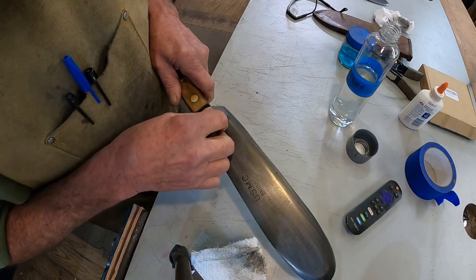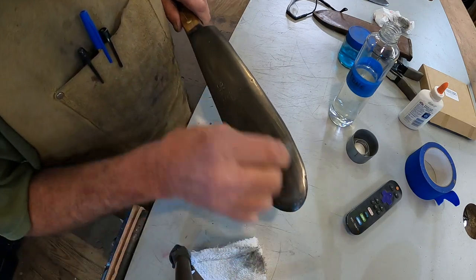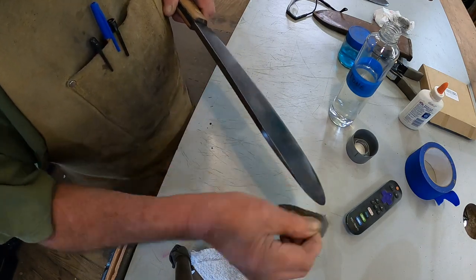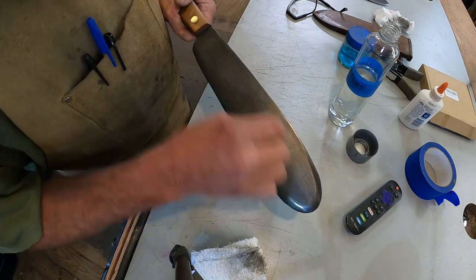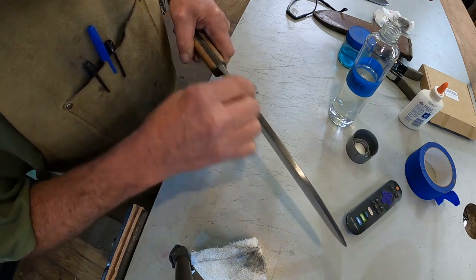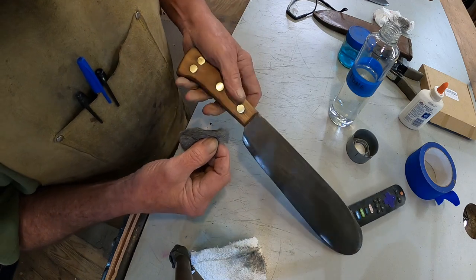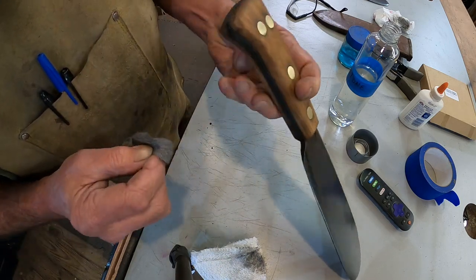All right, go through a couple of steps here. It's been rinsed. Now you take it to steel wool. Polish it. That's to get the residue off of there. Try to even it out some. All these instructions are on your bottle of gun blue when you get it. And this is the same for anything you want to gun blue. Guns, knife blades, any kind of metal. All the same.